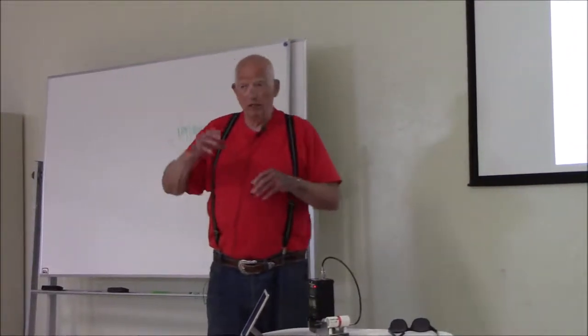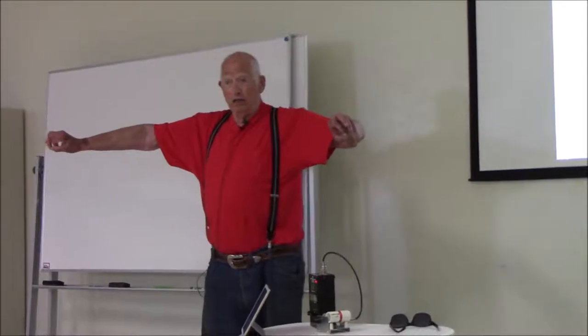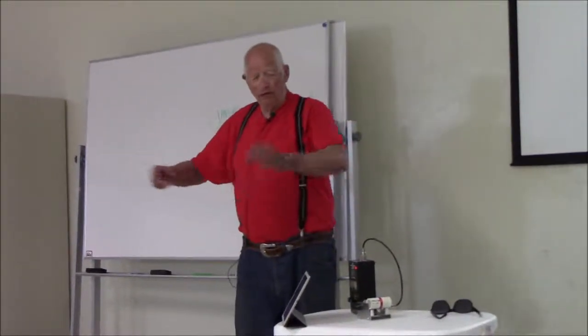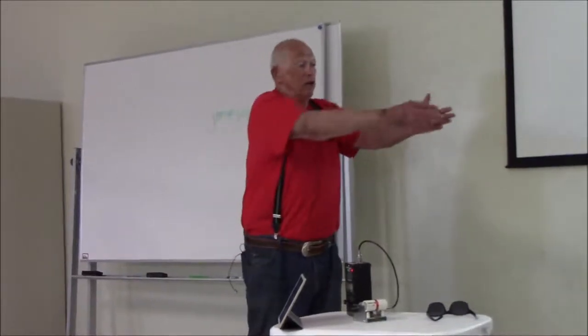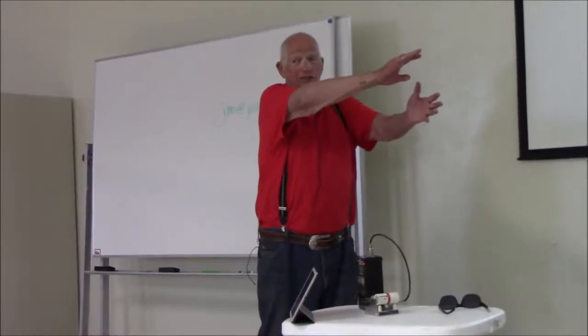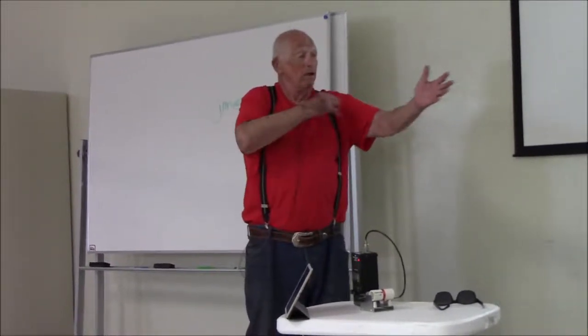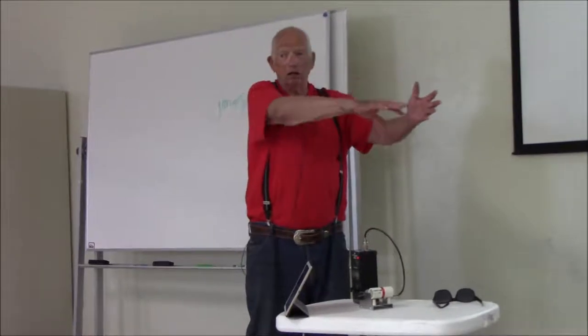And one way you create a flow of electrons is to take a conductor and strip electrons off one end. And that means there's more electrons over here than there are over here. So what do these guys do? They expand to fill up the space, right? And so if I pump them back and forth, here I've got this conductor and I'm pumping the electrons back and forth. When I pump them this way, a whole bunch of them build up on this end and the voltage gets high, positive, and I come down and it gets low over here, and if I pump them the other way, it gets high here, low over there.